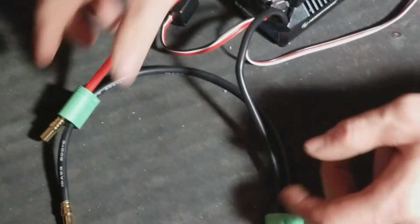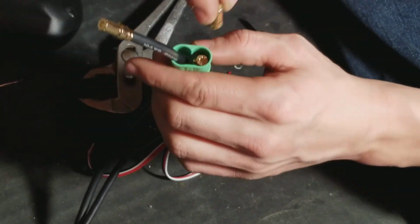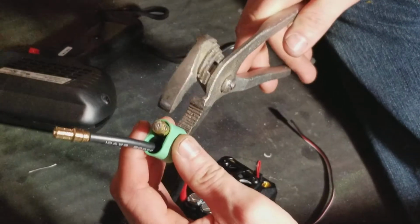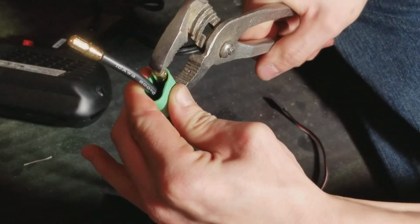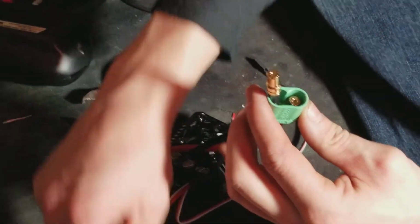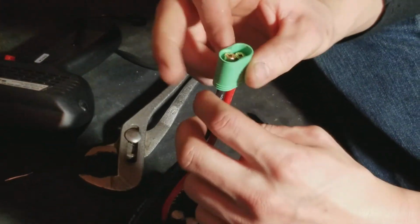So you're going to want to do the same to the front. Grab your female adapter and stick it over the end. Fits all nice and tight, snug. Take this, stick it down in there. Now be gentle. There you go, it pops. That's the rosin, the little dust that you saw in the air. That's just that rosin core stuff. See how the solder's there now? Yeah, so this is fully seated in.